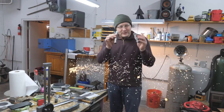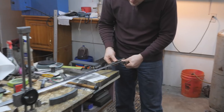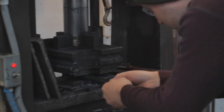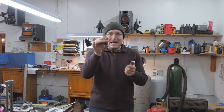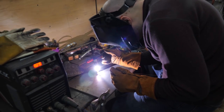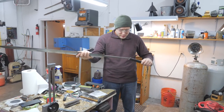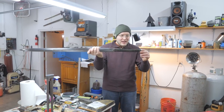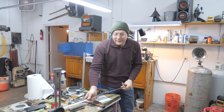I normally use one of these two little thingies here to hammer my guards on to get a really good fit, but these are way too short because they normally go over the tang, and my tang is about twice as long as a normal knife. So I'm making one out of a piece of pipe that I flattened — I milled the end flat and welded a cap on the end. It'll be like one of these for hammering my guard on, only really long for this really long tang. That'll work.